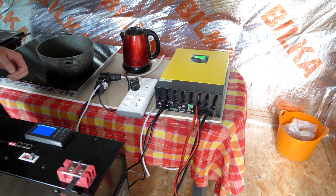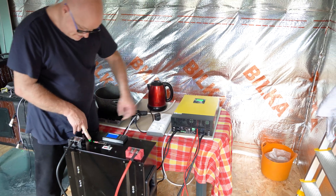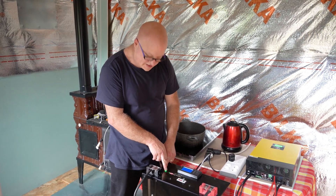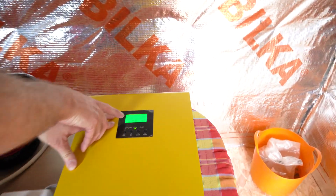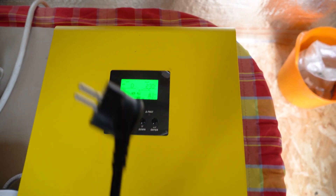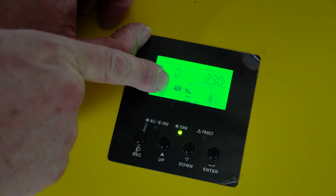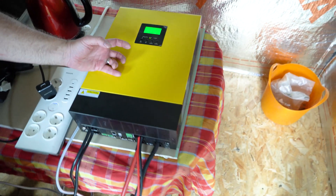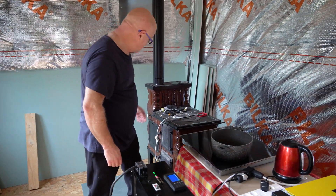Now it's funny — it's like one of those batteries you have for your phone, it just has four little lights and one flashes so you know it's charging. If you look at this display here, you've got a graphical display — there's no input grid power because we're not connected. You've got 230 volts out, you can see the battery charging, and you can see the photovoltaics putting power into the battery. If I were to disconnect the solar panels now, it would just run off the battery — so that's all good.